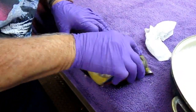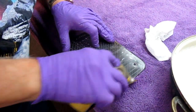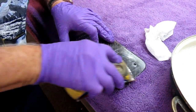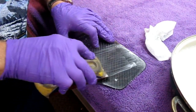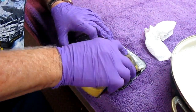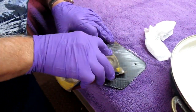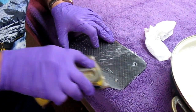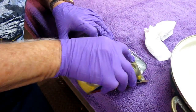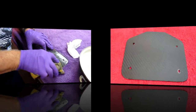Now I'm coming down the home stretch of having this part flat sanded, and I'm paying particular attention to the edges, the parts you're going to see that lie outside the license plate. I'd like to get them as nice as possible. You've got to be detail oriented and fussy, and when you do, in the end, boy is it worth it. When you skip a step or try to outsmart yourself, and I do that all the time, there's just no substitute for toughing it out with the 2000 grit. That's what makes the buffing go like butter.